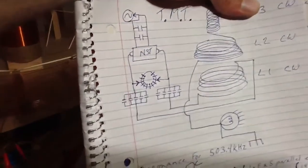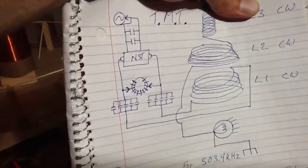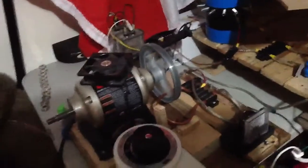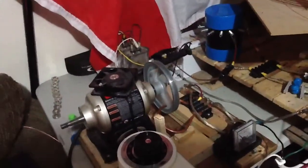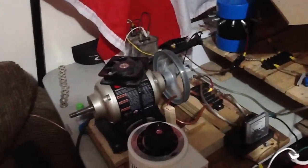I've got the schematic of this thing. We've got the variac with the power factor caps there, matching the inductance on the NST. I'm going to add a rotary gap pretty soon here, and that's going to be pretty interesting. It's not going to be running today though, unfortunately — I don't have the right number of breaks in the wheel; it's dragging the arc across.